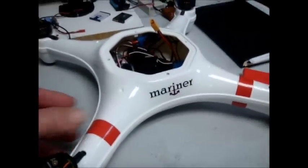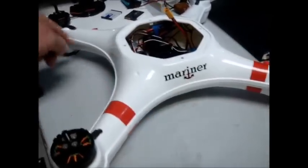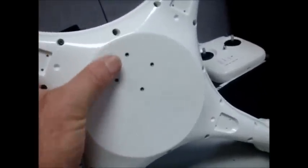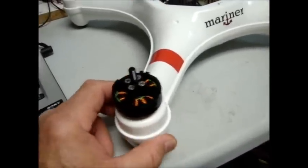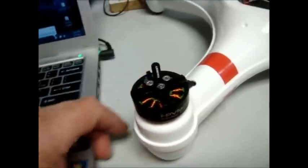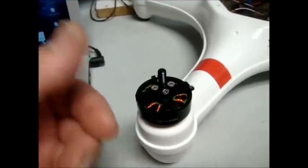Let's look at the original Mariner when it came out of the factory. The mold is a two-piece mold. It actually has an o-ring that sets around the margin of it. The screws on the bottom are all stainless steel and they actually have o-ring seals on each one of them. This is an insert for a platform on the bottom. The motors have ceramic bearings and are very corrosion resistant — if you get them in salt water for an extended period, just hose them off in fresh water and then spray some Corrosion X, which Danny is familiar with from fishing reels.